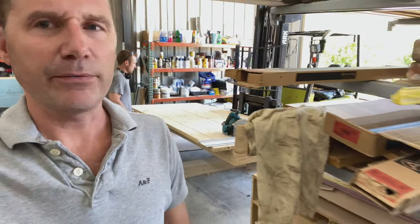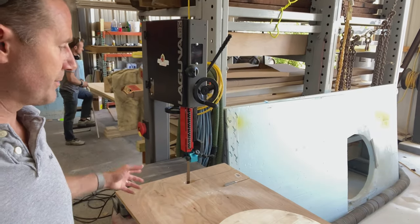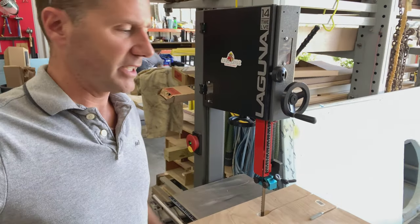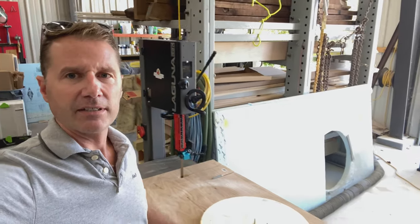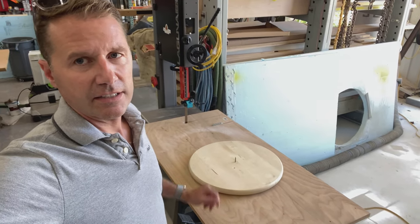Depending on the size panel we're doing, we're just cutting the grooves right away — routering those out and then cutting the circles. We have to get it fairly close to the size of the circle, clip the corners, because it's got to be able to pass through. It can't be too big, but we get the rough shape, then put it on the turntable, start the band saw, turn it in, and it'll give us perfect circles. That's the plan — let's see how it goes.